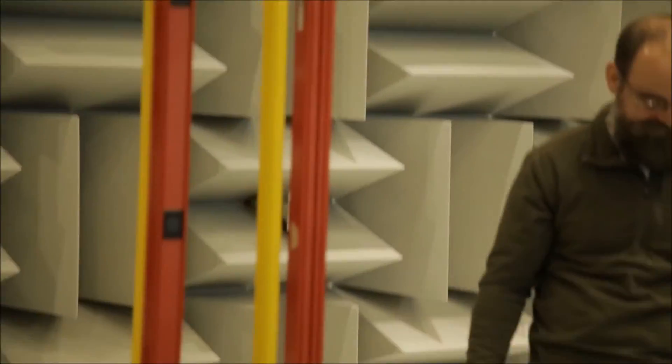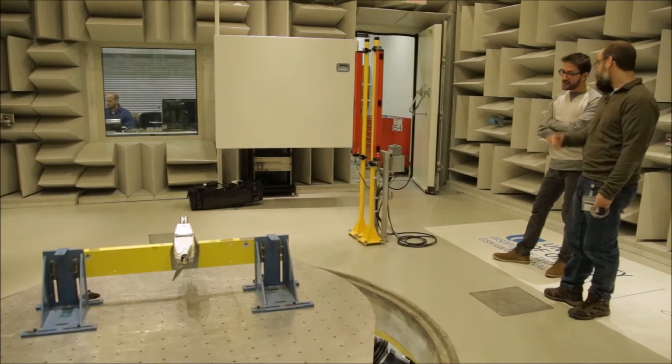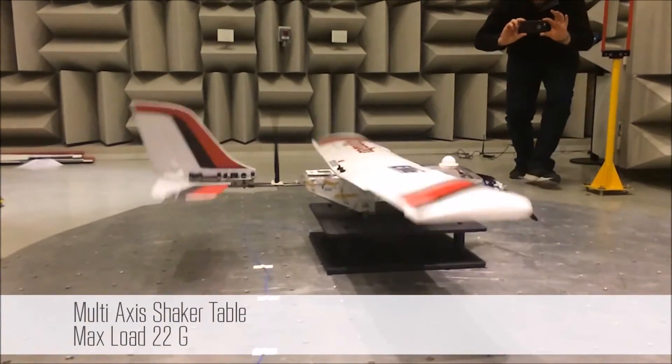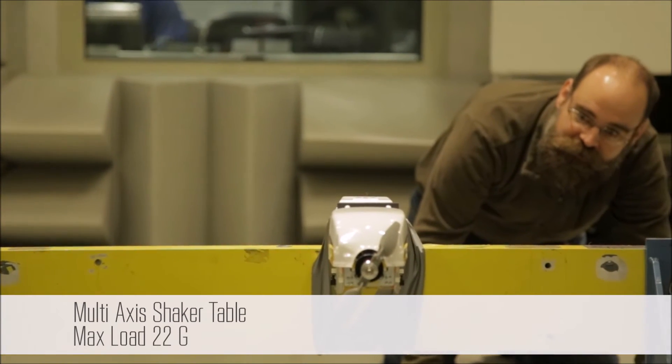We're doing like 90% of what the table can do. This is way more than what we're going to see in flight — this is going to be really good, possibly even more valuable than the aerotesting. I think we're going to go back and look and see cracked seams on the solder. We're going to crack the solder and we might lose some to debris. We're going to be doing certain shakes that will mimic what kind of aerodynamic forces the rudder will see in flight. Then we'll do a bunch of other shock tests that mimic landing over and over again — we will literally do hundreds and thousands of landings. Then we're going to take the aircraft apart and understand where it was stressing, where it was fatiguing. When the engineers go back, they'll iterate on that. And when we're done, we'll have a piece of equipment that is truly robust and truly reliable for our clients.